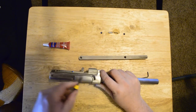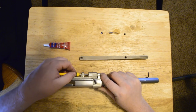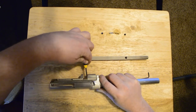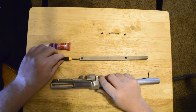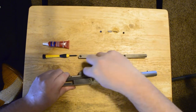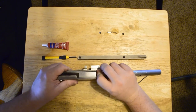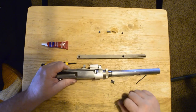With the piston block all the way back against the receiver, we want to ensure that the guide pin is screwed in far enough that it does not extend into this gap, or else it will damage another part of the gun. The guide piston rod should be below flush with that block and should allow the piston to move forward and spring back.